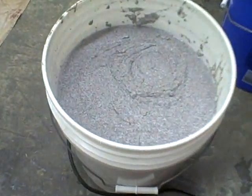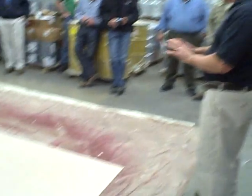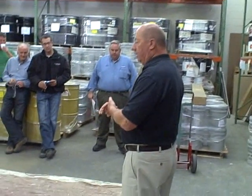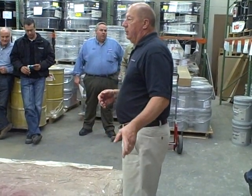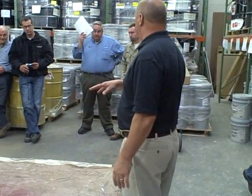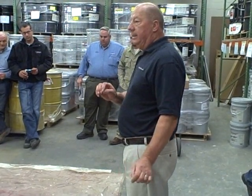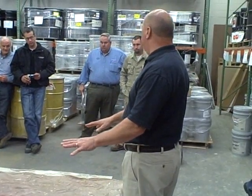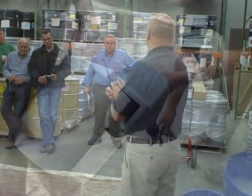This one here is kind of beige. You want to put down a base coat of product first. I would suggest a Flexible Concrete Waterproofer as one of your base colors, similar to the color quartz you picked. Because when this goes down it's going to go down milky, but when it dries it dries crystal clear — all you're going to see is the color of the quartz beads. If you didn't have a good substrate and tried to shoot over it, you'd get a lot of mirroring through and wouldn't have a consistent color.